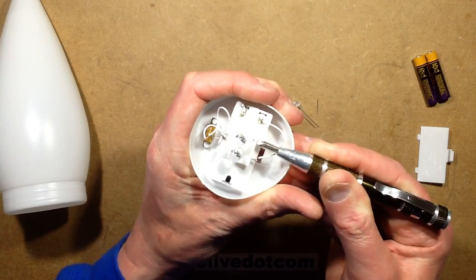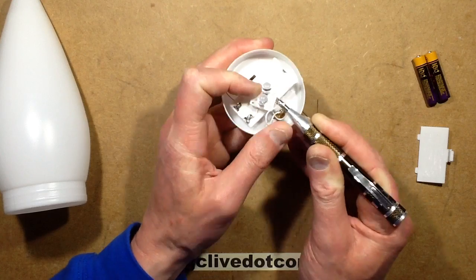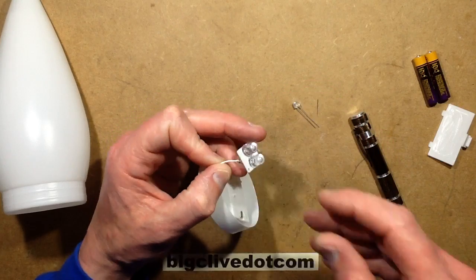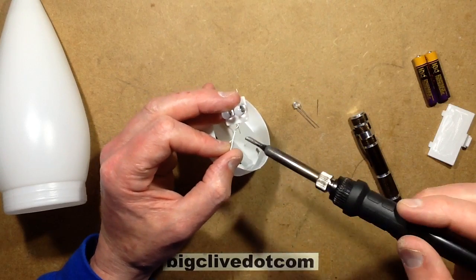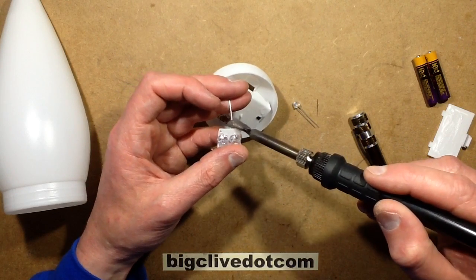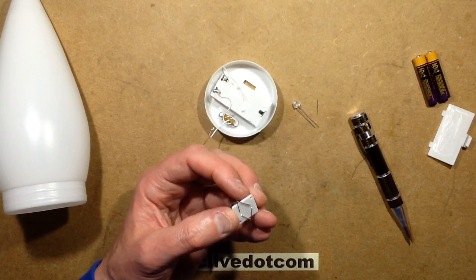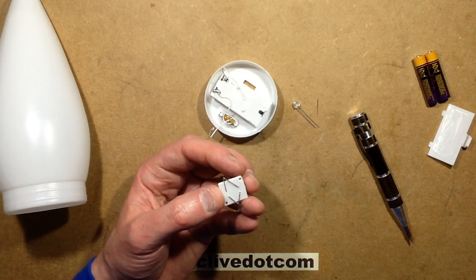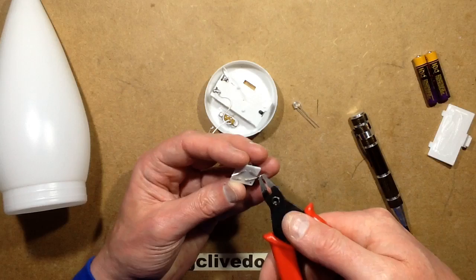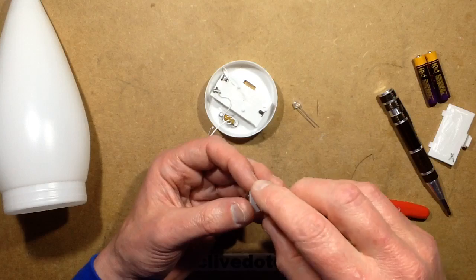The existing arrangement is a plastic plate held in by two click-on tabs. I'll pop those off - there we go. I desolder the leads off the existing LEDs. That's one off and that's the second one off. I'm just going to crop the leads of these LEDs - that's probably the easiest way to get them out. I'll leave enough length to reuse those LEDs because they are quite nice, they've got very smooth color-changing action.